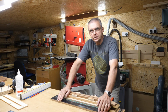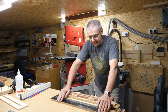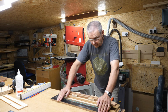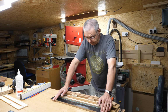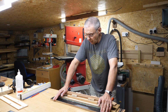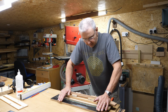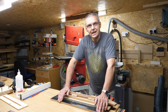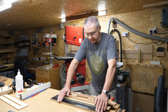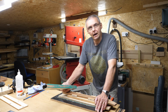Now, this is a warts and all series of videos, and it's all right having all these fancy jigs, but you've got to make sure that they actually do work properly. The problem with this jig is that the piece of wood that's supporting the neck doesn't run the whole length of the neck. So when I run it through the thicknesser, the rollers are pressing down unevenly on each side. As a consequence, I've ended up with a neck that's probably not as flat as it was when I started. Never mind, into the trusty leveling beam, and hopefully I can fix this.